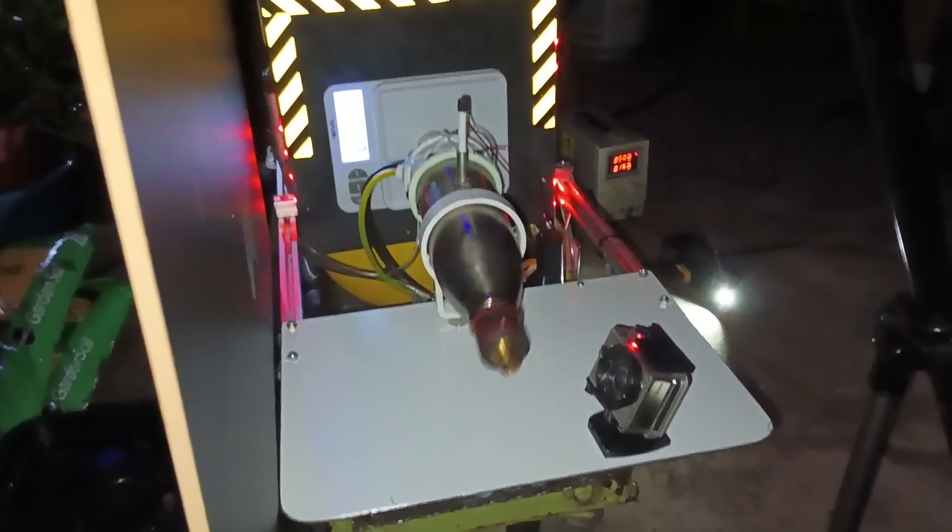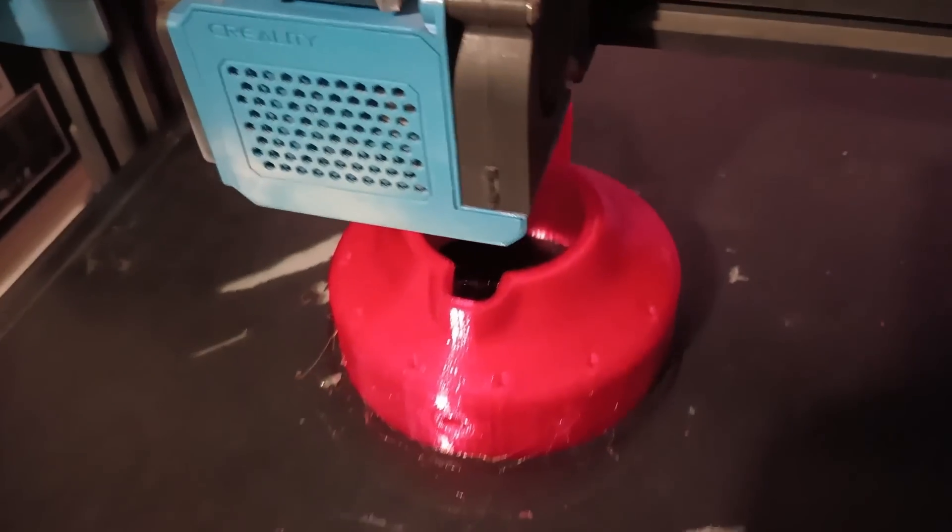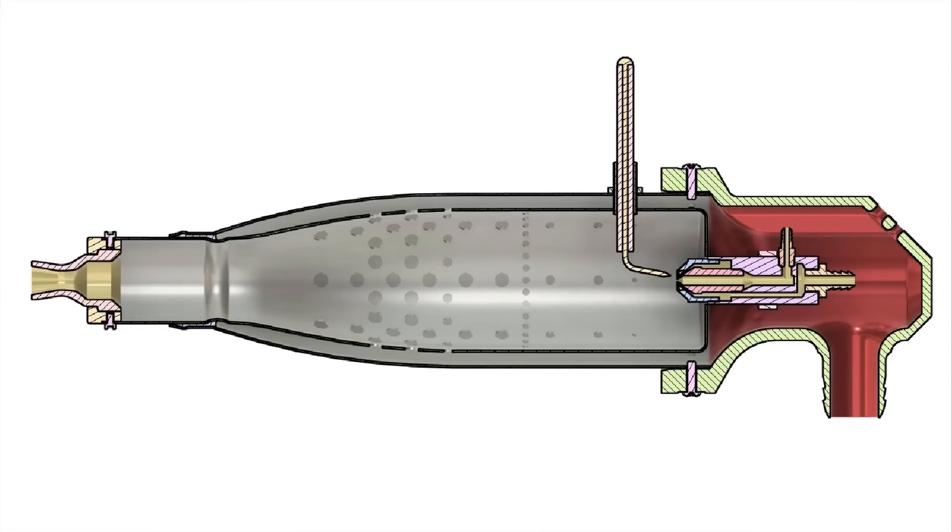With lots of hard starts from the 3D-printed adapter rupturing, this design was looking no better than the previous one. I redesigned the adapter and the igniter so it would have less chance of building up excess fuel in the chamber. Once reassembled, I gave it a try at about half power.